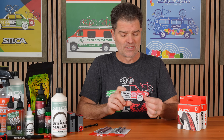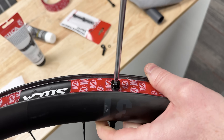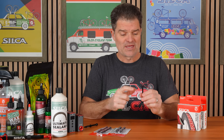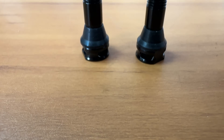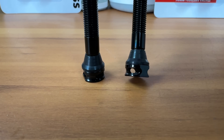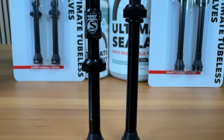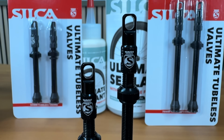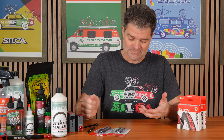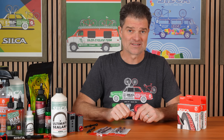These come in 50 and 70 millimeter lengths. We broached the back for a four millimeter hex key, so when you're doing the install you can actually get a good purchase on it with the hex key to tighten down the nut at the top. And then it has multiple cross drillings at the base so that if you are running inserts, you don't have to be super careful about insert position and worry that it's blocking the flow of air coming out — because you've got those nice little cross drillings in there. We all came to the conclusion that this was honestly the best, easiest solution out there.